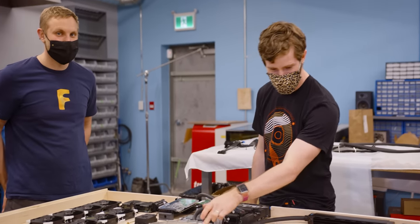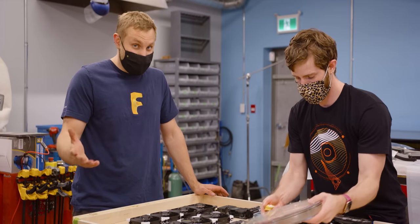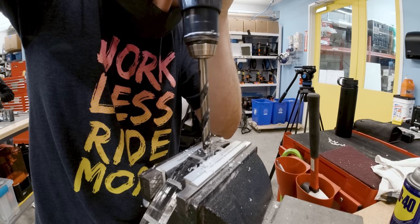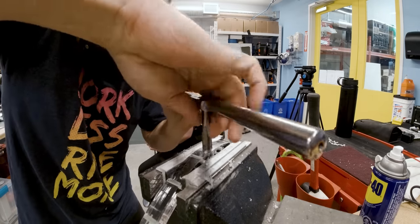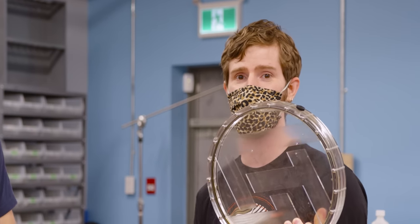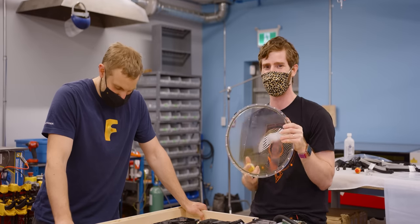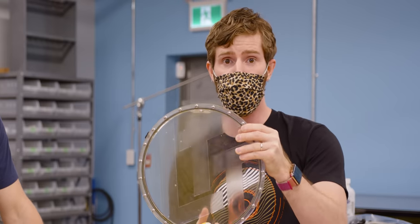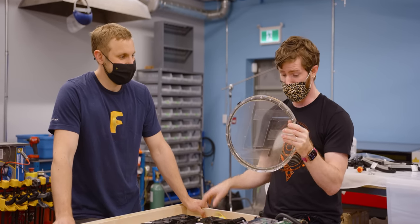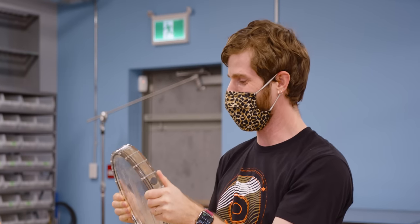Other than the res being done, this looks pretty much the same as last time - it's changed a bit. The reservoir has been redesigned again. Now instead of being a three-piece design, it's a four-piece design. The most failure-prone part of building this thing is drilling and tapping the G1 quarter holes. The new design does nothing to make acrylic less brittle, but if we can do that brittle finicky part before we invest a bunch of time etching and cutting the 18-millimeter thick acrylic ring, at least it's not so heartbreaking when it breaks. The port arrangement has also moved - we've gone up to three ports from two. It looks freaking awesome, and it's full of water.